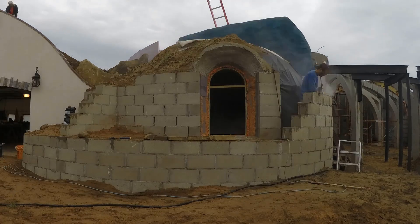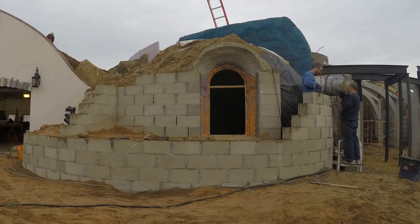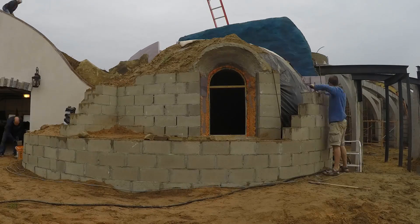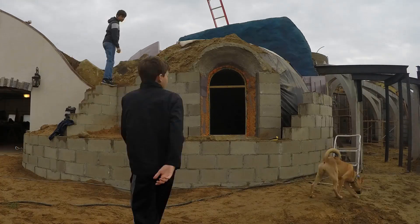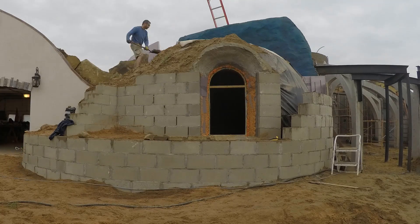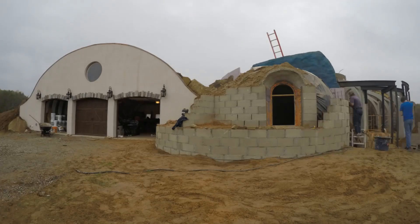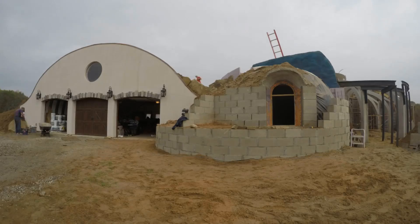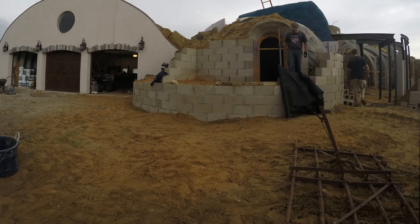One quarter of the way through the video and we've got a lot of manual follow-up. We still have to finish up that block wall that blew out during the first burial phase. This time you can see we filled all the cores with concrete and made sure it went all the way to the bottom. We put in lots of horizontal reinforcement too. Meanwhile Sherry and my mother are in the background preparing the surface for grass seed. You can see we're backfilling that first half of the wall while the excavator bucket can still reach over it.